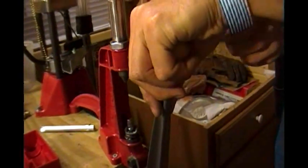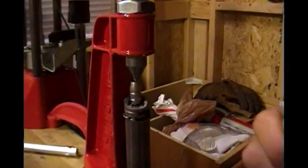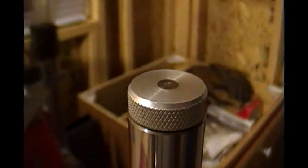Observe the full motion here. The ram comes up and the ball is about to touch the top of the bullet. We just touched. We're going to pay close attention to the top — you're going to see a plunger come up, and when it's perfectly flush, that's when I stop and hold it for 30 seconds. I'm also going to run my finger across the top to feel that it's flush. That's what we do, and that's all there is to this — just hold it there for 30 seconds.